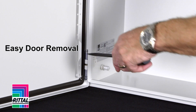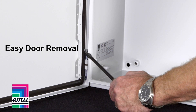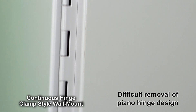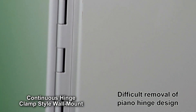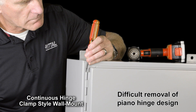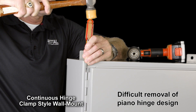To remove the door for holes and cutouts, it's simply removing a hinge pin from two hinge bodies. The same task on a clamp style box requires the removal of the piano hinge — and to do that, you've got to start with possibly a mallet and an awl, some type of tool to knock that hinge pin through, then use a cordless screwdriver or a drill to grab that pin and spin it out.